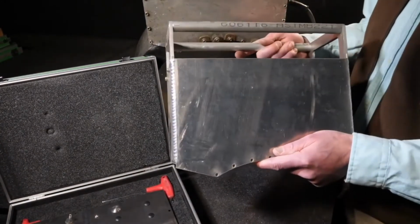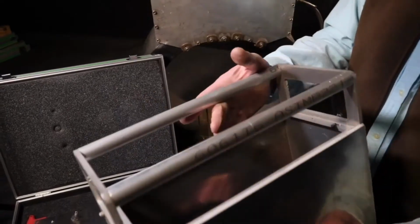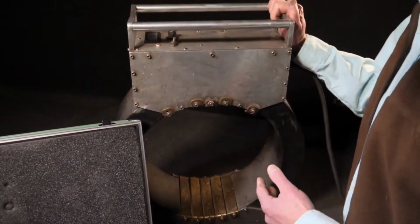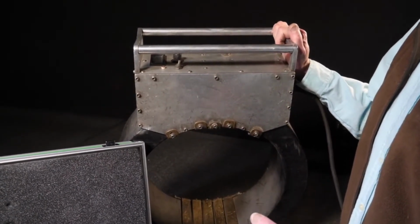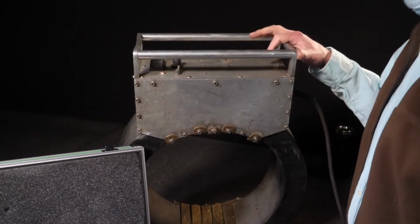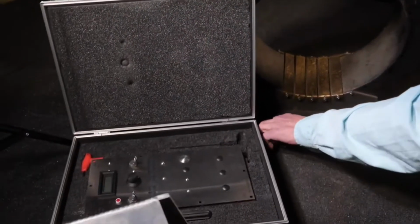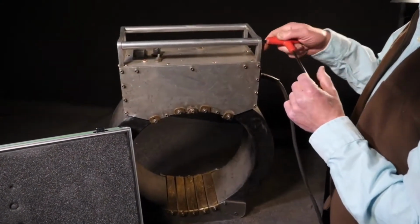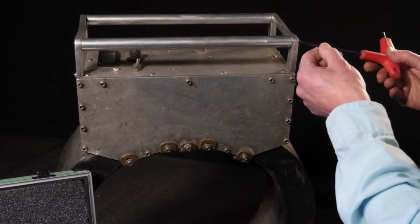We've had these around for about 14 years or so. This coil that we have here is the WDV14, and it was made in 2003, so it's now 18 years old. Okay, so the first thing we need to do when we're servicing coils is to get our larger Allen key. I love T-handles, especially these ones where I can go in and get a good grasp for loosening it, and then I pull the fastener out.